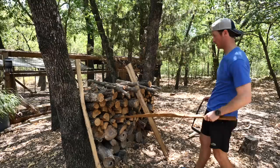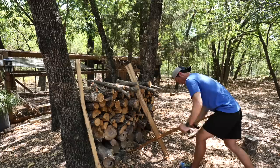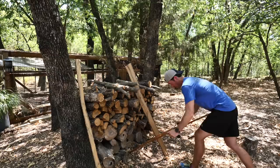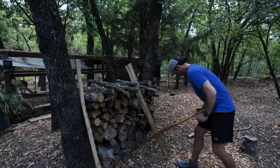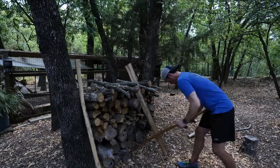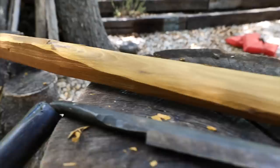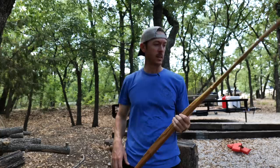Working on the bow - it's good exercise. I'm getting a lot more power using this draw knife; the wrist isn't going to get as good a workout though. This is hard wood - I really want to take a lot off this midsection. As I'm working through this, I can start to see that yellow wood underneath. This is my first piece of osage I've worked on that's truly been dried out for a long time. I've got the first little layer of the onion off and into some of that yellow wood. We're going to keep ripping the sides and the belly until it starts to bend.